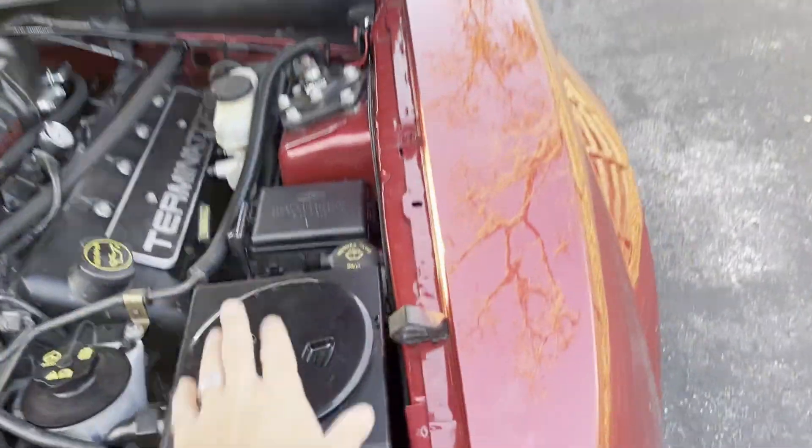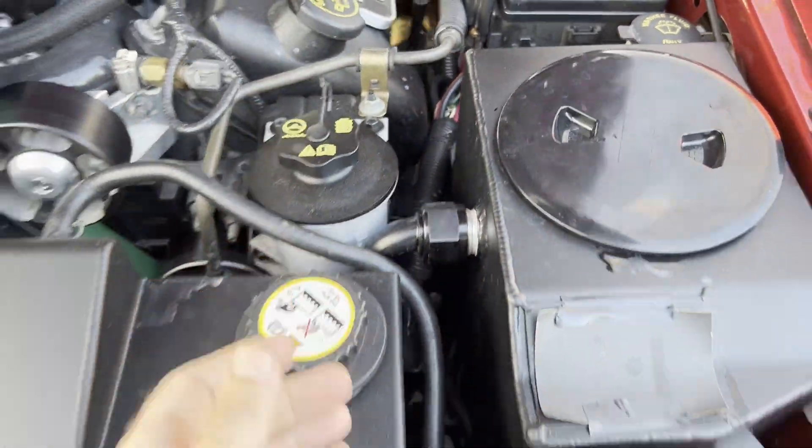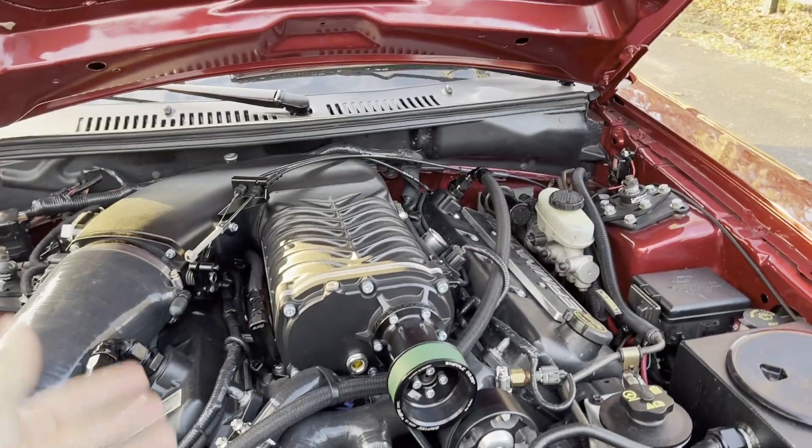I've been trying to get a little bit of tuning done, but running into an issue. This tank is getting so hot you can't even touch it — it's gonna burn your hands. IAT2s are about 200-some degrees just barely cruising down the road.